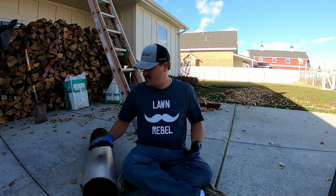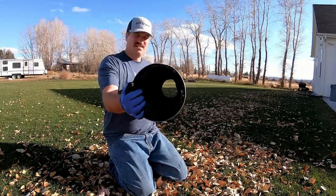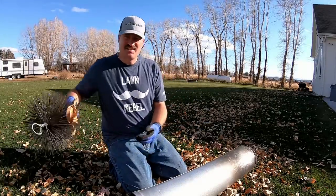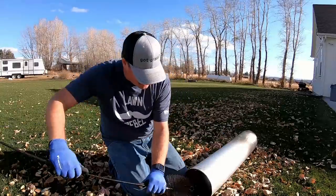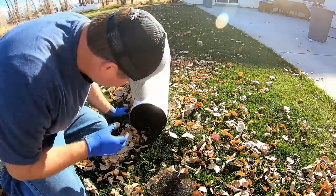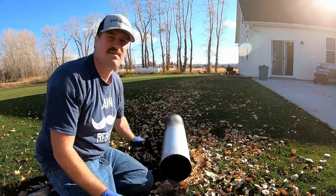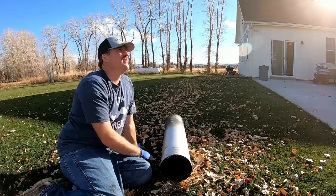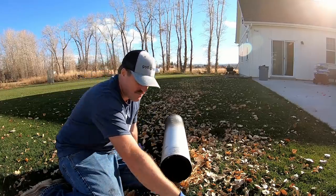I'm going to sweep this section over here on the lawn so I don't have to deal with it up there. To sweep the chimney, you just do this as it's standing up — this is a section that I took off. You just take the end of the brush and put it down in there and sweep it like that. That's all there is to it. If you have a lot of creosote in your chimney, sometimes it'll come out kind of chunky and you'll get a lot of it out. My chimney never has been chunky — maybe I'm just sweeping it a lot.